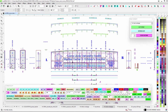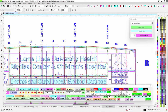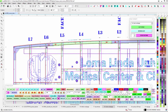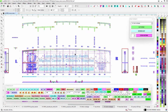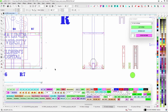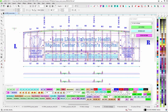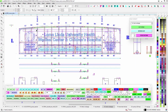So working from the bottom, you'll get all this in, get all this structure, slide these in, slide in your 2x2s. You've got vertical 2x2s, slide those in, and then once all that's done, then you can lift and bring, slide the lid on, and go ahead and attach all these to the uprights and close it up. I got you lift point things like we do, just to give it some added strength, top and bottom. You burn those. So just to make sure it's nice and strong, because like I say, this thing is almost 22 feet, and we're going to be lifting it here and here. So we want to make sure that this thing's super rigid.